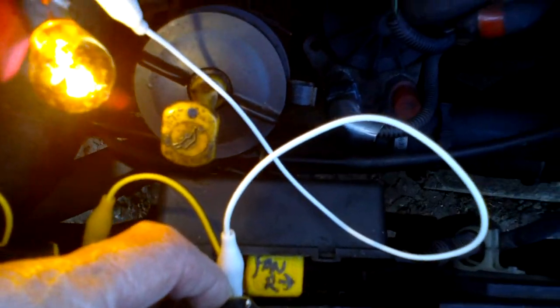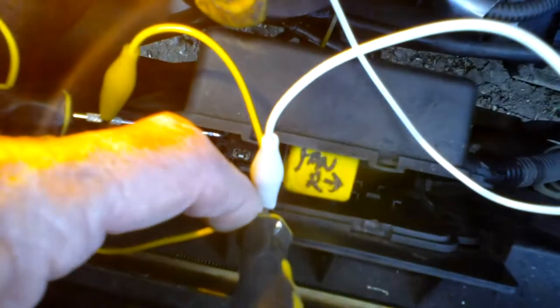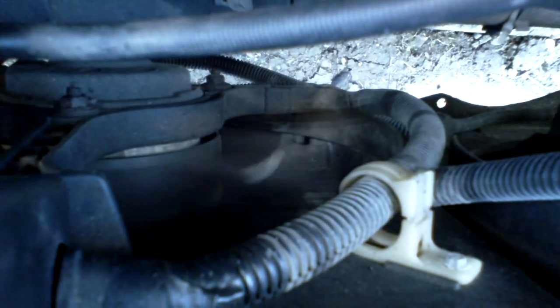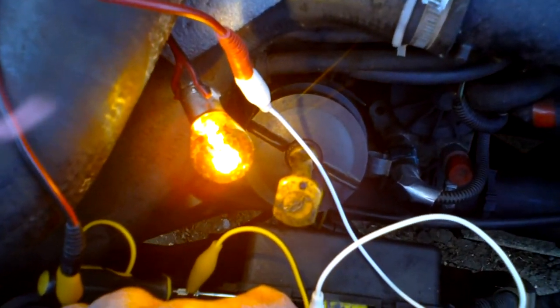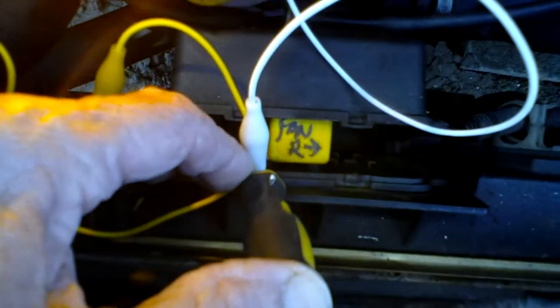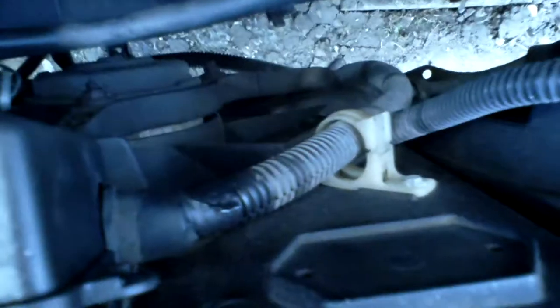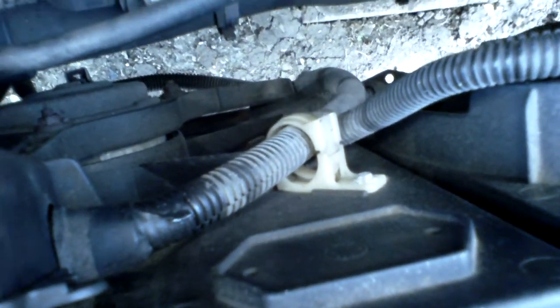I've got the connection now - and you'll notice that the fan is spinning. It's going slow and the reason it's only going slow is because of the load of the bulb - the bulb is taking the power from the fan. You've got to have something like 21 watts to do this, and that's just enough to kick the fan and tickle it. I'll take the connection off now - and there we go, the fan stops. Nice and simple.